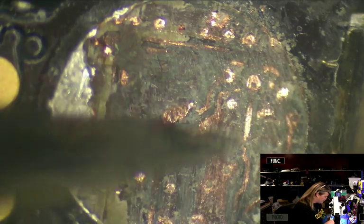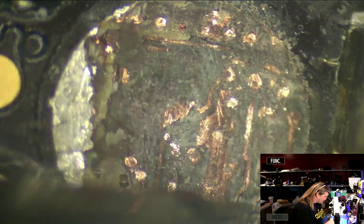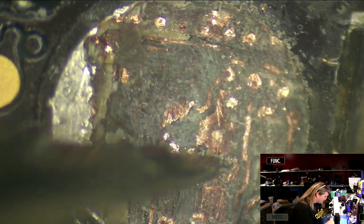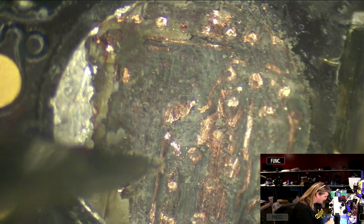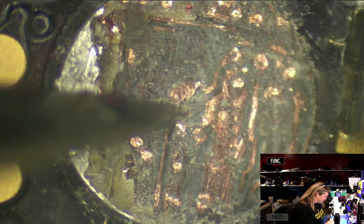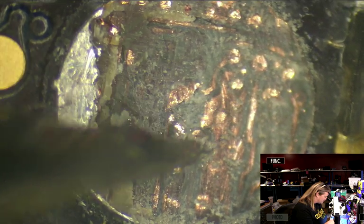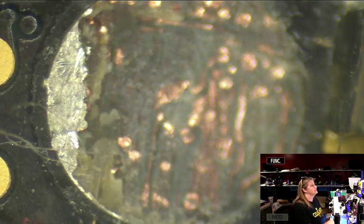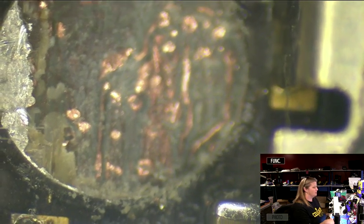A lack of schematics is not really going to mean the end of board repair, even if that does sort of turn out to be a big stink. You just sort of scrape very gently and reveal the underlying architecture underneath all of this substrate. We can see here is a line that looks cut off right where the screw impression is, and it looks like it should connect over here and go on up to this microvia — that looks like a break in the track. And if we map that out, it turns out that one is an important main data bus line that talks to a bunch of stuff across the board.